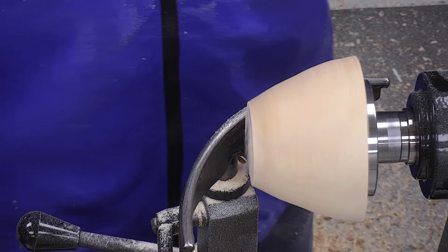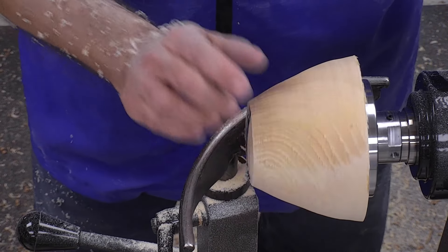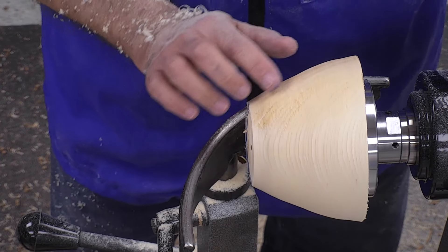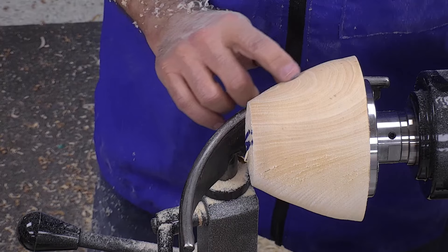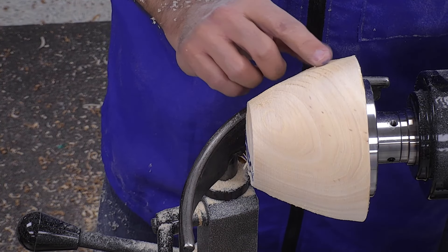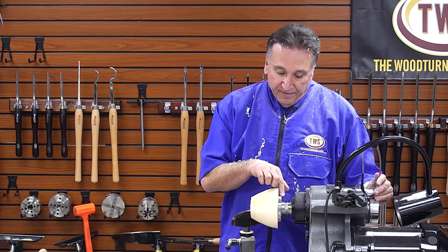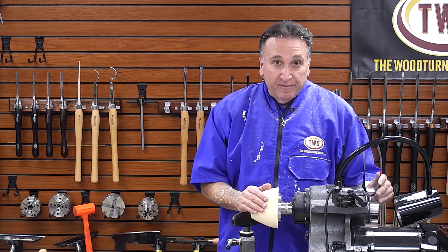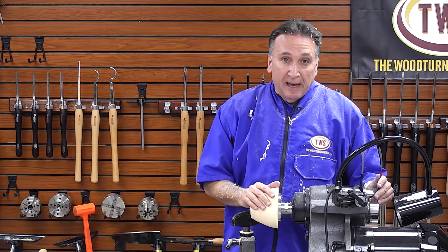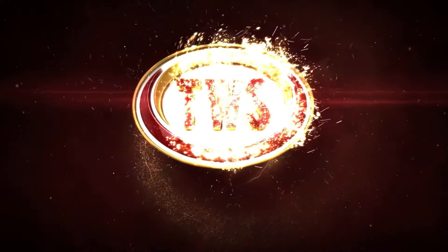One thing you may have noticed — because I'm no longer doing heavy roughing cuts — is that I moved my body position over to the front of the lathe and was able to come in straight. Even though we're going into that end grain, I have some tear-out here that should be sandable. So that's it for this video. We have our shape cut with carbide turning tools. In our next video we'll turn a tenon in preparation for removing it off the faceplate, chucking it up, and turning out the inside of the bowl. I hope that was helpful — if you have any comments please leave them down below, don't forget to like and subscribe, and thanks again for watching.